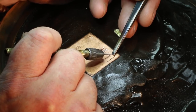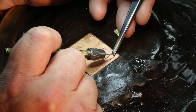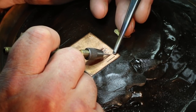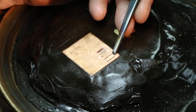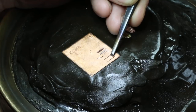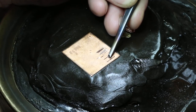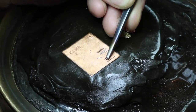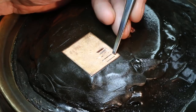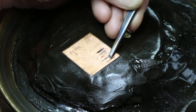So we're going to angle it ever so slightly. For 90 degrees it's just so that this edge is sloping back a little bit, as if it's sort of dragging. So by coming in at an angle, this safety edge here can run along this wall of the V-cut. So as I go in there, I take it and I can see the chisel go to the bottom. I can see it's just not catching because the side — the safety edge — is running on the left-hand side of the V-cut. That was just a slight angle. Now I'm going to do a bit more. Same principle — basically leaning the chisel away from the wall you want to protect.